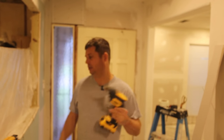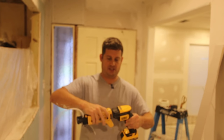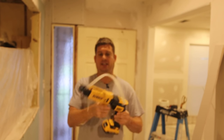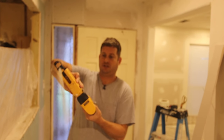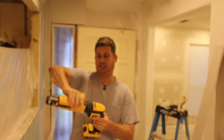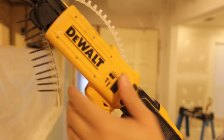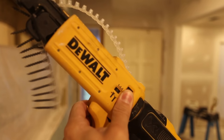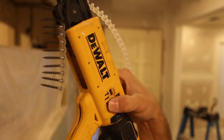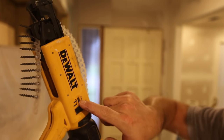Other than that, this is a pretty darn good tool. It snaps in like this — you just push those and boom, it snaps in. It will operate at an angle, so you can turn this to whatever you need. It has an adjustment for screw depth, so you can simply turn this and it moves a little indicator here which sets the depth of the screw.